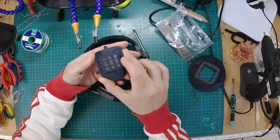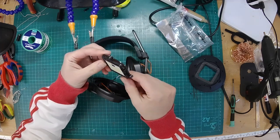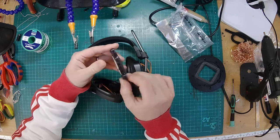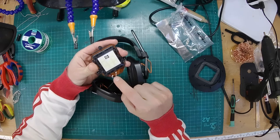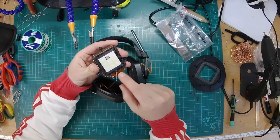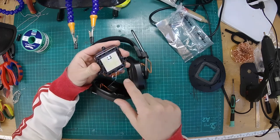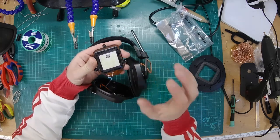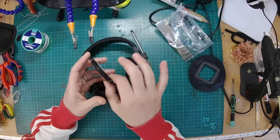As you can see, you'll have magnets either side, and then somewhere in the middle you'll have a diaphragm which wobbles backwards and forwards, pushing the air around, and the cable is soldered to this little circuit board which is on the diaphragm. So the diaphragm will have lines going up and down it. As I said, we're not going to really modify this that much at the moment. We're going to just change the socket that's in there.